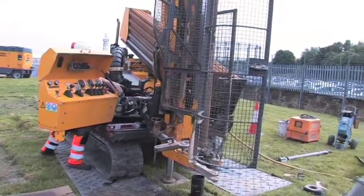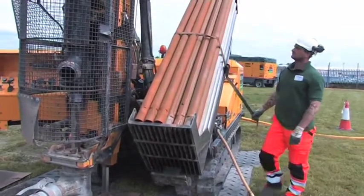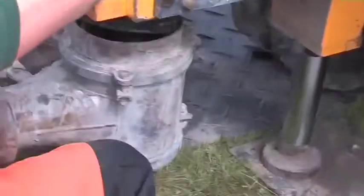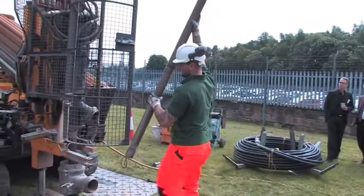What we intend to do is drill through the overburden and at least two metres into bedrock. This metal casing, which is driven into the bedrock, is then sealed with a grout. This is to prevent contamination of the groundwater with surface water.